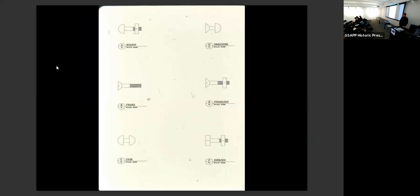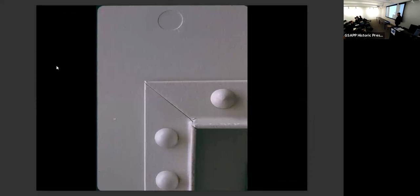Fasteners. We talked about the number of rivets and fasteners. I had spent so much time on fasteners on this project. There's always one aspect of a project that takes 10 times as much time as you think it should. And so much was fasteners on this one, you know, rivet heads and other things. In this particular case, Charles Wilson must have really loved rivets. But on this particular building, he had many too many of these rivets where he wanted them to show, and they didn't need them. But if he had to attach a piece and it required a rivet where he didn't want to see a rivet, he put a flathead rivet. A flathead. I didn't even know they existed at the start until I looked at it and I realized, wait a minute, he put a flathead rivet on because he didn't want to see a rivet there where it had to be to attach it. And sure enough, that's what he did.